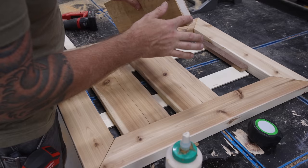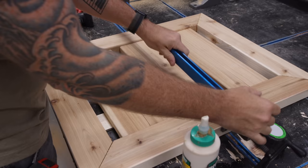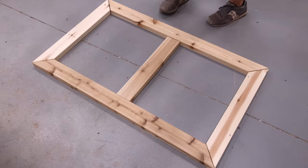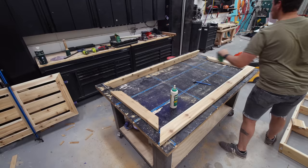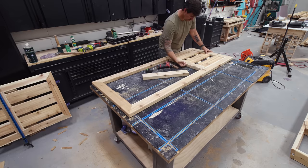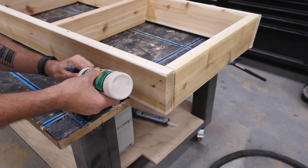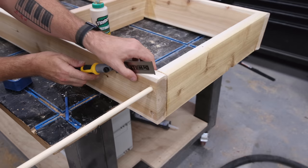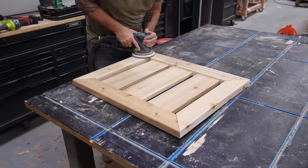I've got a few scraps of quarter-inch plywood on my workbench to space the slats inside those 2x4 frames nicely, and I'm using a 1-inch wide scrap board to space the slats from one another. The back panel for the loveseat and the couch work exactly the same, but I've added a vertical 2x4 to break up those slats. At this point I can go ahead and fill the dowel holes — I used half-inch dowels on those lower seat frames, but if I built this again I'd use three-eighths dowels everywhere. Once those dowels were added, I could sand.